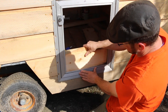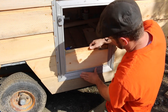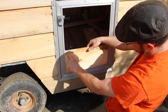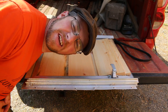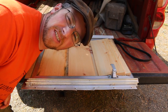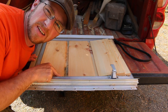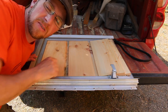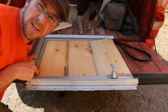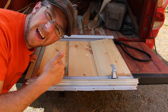No way, don't tell me that actually lines up right where we need it to. That board — tell me that wasn't meant to be. I told you in the 30 random facts video, I'm a little bit of a perfectionist sometimes. That bottom board is about a quarter of an inch high compared to the other boards, so we got to rip this down. I'll take a quarter inch off the bottom and then rip the top board to get that looking nice.